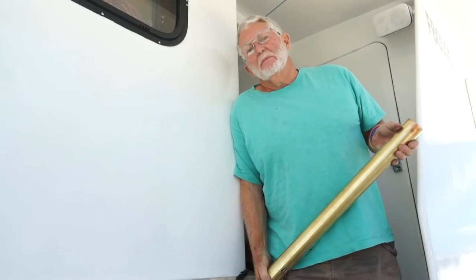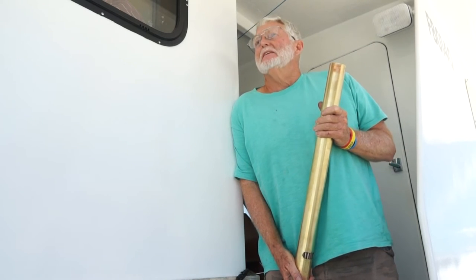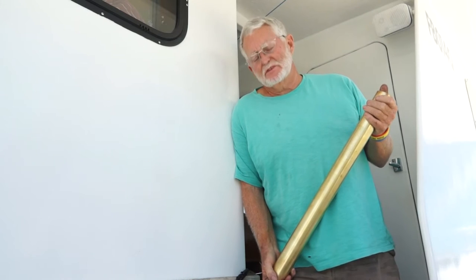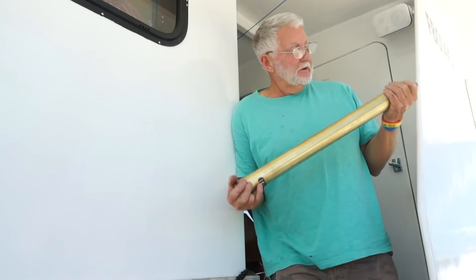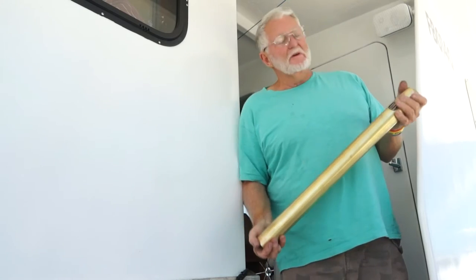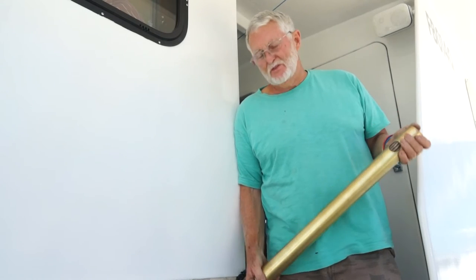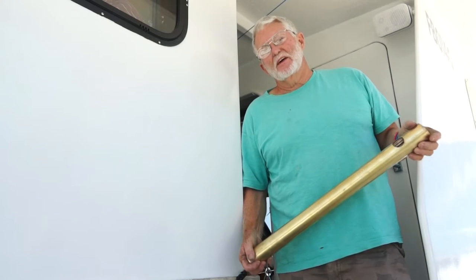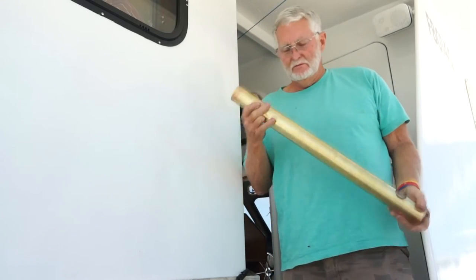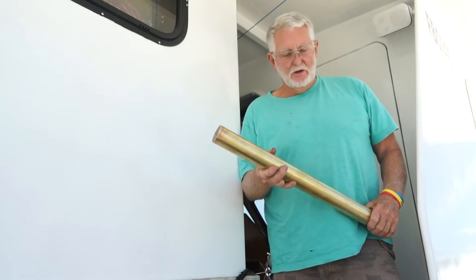I'm back from Core Cooling. Unfortunately, the tube stack failed the test, and it's a little bit expensive - these are $800 a piece. But I've got 16 years out of the other one, so that's not too bad a run. I've got two new tube stacks - I'm going to do both motors, because it's false economy to think the other one's going to go much longer. Both engines have been serviced at the same intervals, they're both the same age. So if one side goes, chances are the other side's going to go pretty quickly as well. All I've got to do is install this new tube stack - it looks like gold and nearly cost that much - back into the heat exchanger.